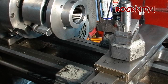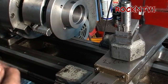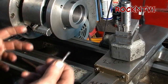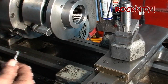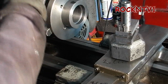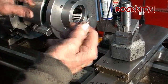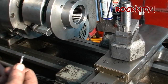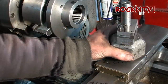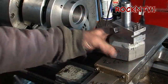Just for ha-ha's, what we're going to do is — now that this is in here — I know I need to take 300, 310 thousandths off, which will still leave it about 100 thousandths longer than this here. I'm doing that only because I wasn't smart enough to see where the threads ended off in there. However, it probably doesn't need to be, and I'd be protecting the threads inside of here — in case you're sticking materials in, you're not beating the nose of the thing.